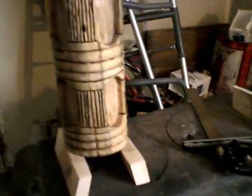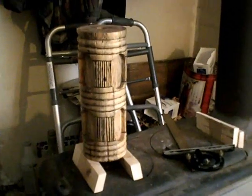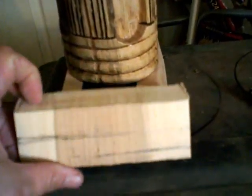Okay, this is what I'm going to show you so far. This here is the plinth — whatever you want to call it, the upright for the lamp. And this here is going to be part of the base. I've got it flaring out from the bottom, and then there will be a piece of wood coming down to fill in the hole area. In order to figure out these angles, I didn't want to just cut them arbitrarily because I'm limited on my width — it's got to fit on my headboard thing, so I could only go four and a half inches. This here is three and three quarter. So I had to draw it out on a piece of paper and take a protractor to figure out the angles.